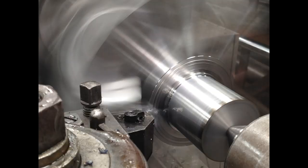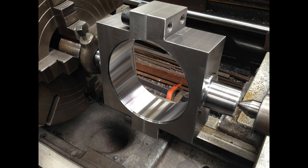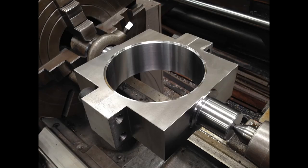And we also had to do a little more facing. As I said previously, there's a bit of a shoulder there behind the trunnion that's 1/8 inch long. And here it is, making my first cut, taking a 1/16 off, bringing it in. And there it is, finished up. As both ends finished, you can see on the right side that shoulder I was talking about that I faced into it. Another finished shot there.